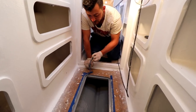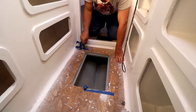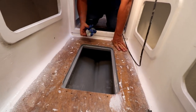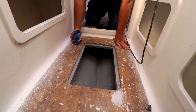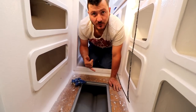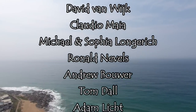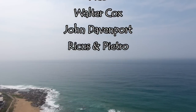The final step before it dries: just take your edge tape off. Take that edge taping off and you've got one sealed floor. The floorboards — the boat soles — are epoxied on the underside so they've been sealed from there. All we did now is seal the new opening, and there you go — looks brand spanking new. That's how you restore your bilges. If you enjoyed this video give us a thumbs up, subscribe below, and let us know if you like our how-to videos. Join our Patreon family for behind-the-scenes footage — the link is in the description below.